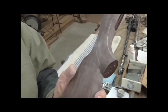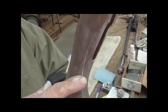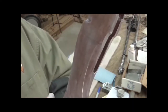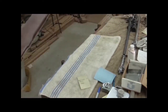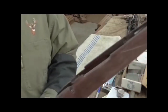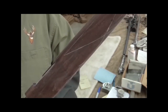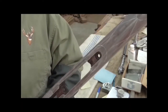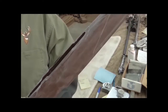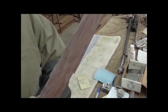Those lines show up nicely. Now you don't want to leave that powder in there when you finish — you want to blow it out with compressed air, because the finish will clog it up. That powder will turn back into finish and just fill that groove up. So blow it off with compressed air, then take a tack rag or a clean t-shirt with some mineral spirits and wipe it lightly to take off any fine dust. Blow it off again and let any dust in the shop settle before putting another coat on.